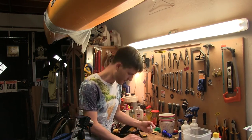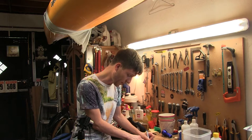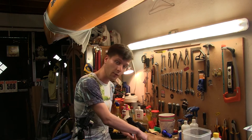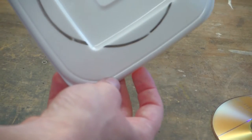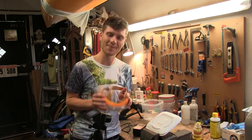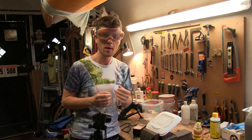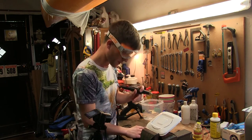Let's start by drawing around our CD — or in this case DVD. This is where the fan's going to be. After we draw around this, we're just going to wipe off that black marker, which is why it's always good to use a dry wipe pen. Now, this CD is around about 12cm in diameter, which is the same as the fan I'm using. The objective when cutting is to cut about half a centimetre inside the circle, because the fan diameter is a little bit less than the CD. Let's start.